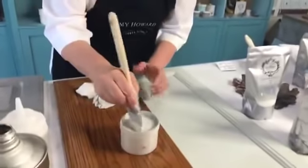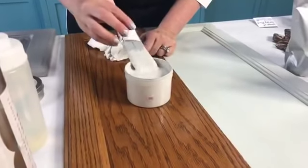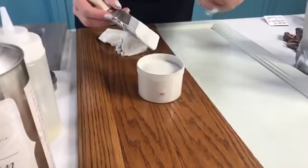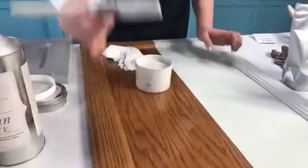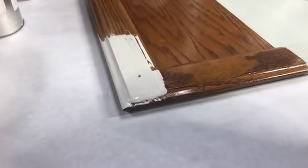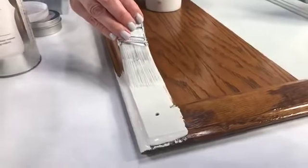See how thick the consistency is. Our One Step chalk-based paint can go on top of something that's already lacquered, on oil-based finishes, on mahogany or cherry — anything old you're rescuing and restoring. You can use it on melamine, resin, plastic, and even glass. On glass you've got to allow it to cure for about 72 hours. You'll notice I'm using a synthetic brush, doing long clean strokes.